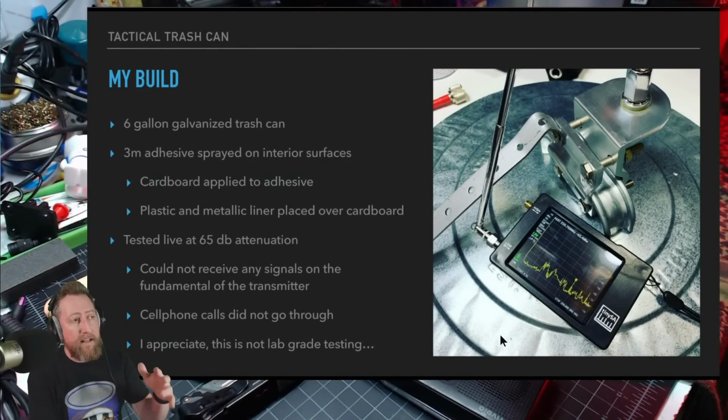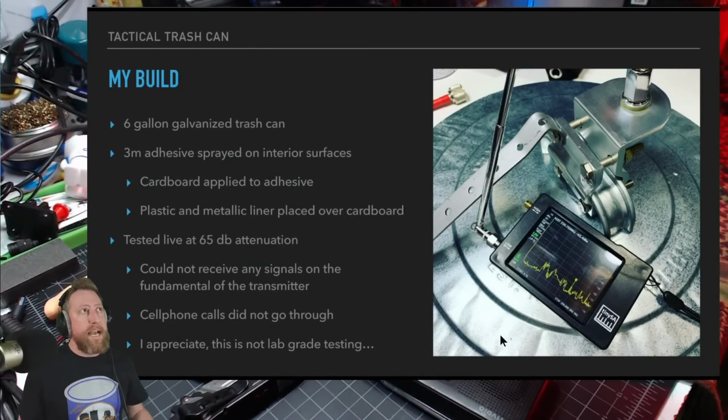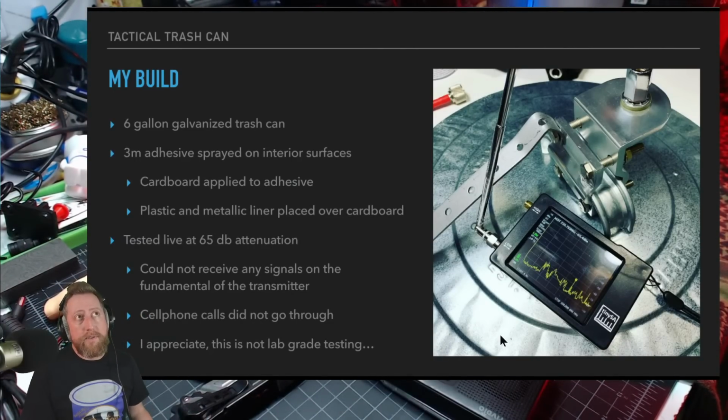And then I applied metallic packing material, a little bubble pack, if you will, with the metallic backing up against the inside of the can, again to have a little separation layer, another layer of electrical separation. I tested this with about 65 dB of attenuation, and the link is in the description so you can go see the testing procedure. That was literally taking that tiny SA, which, again, is not a lab test, I appreciate that, and putting the tiny SA on the fundamental frequency in the trash can, sealing it up really tight, or as it should be sealed, and then hitting it with RF.